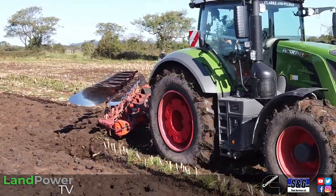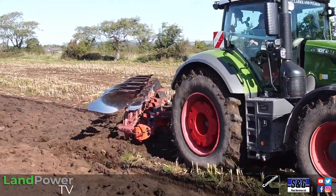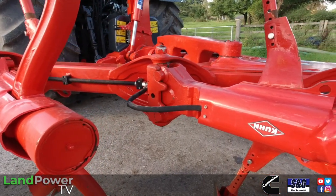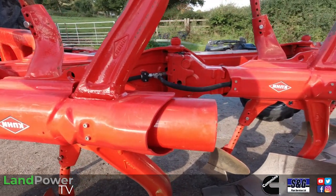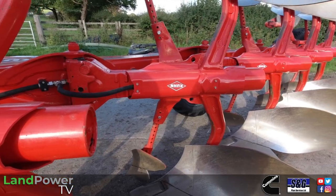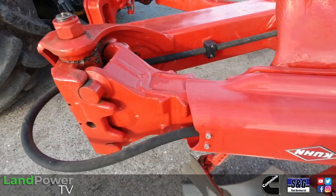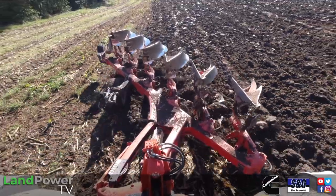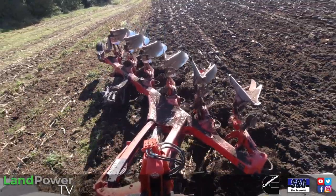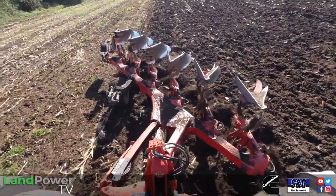She's an auto reset, and as we'll see now and again when we come across a stone, one of the legs trips back. She's a six furrow machine and the auto reset is done through hydraulics. We've set the pressure so we can tailor the auto reset to the field conditions. If we're in a light loam but it's really stony, we can reduce the pressure, but if we're in a heavy soil in a dry year, we can increase it so it's not breaking back unnecessarily.